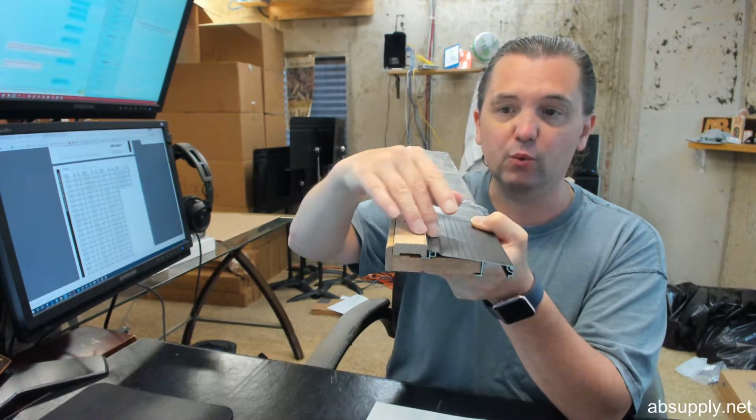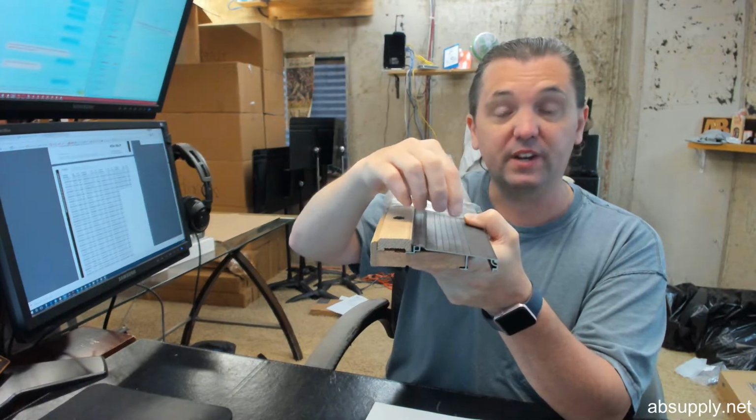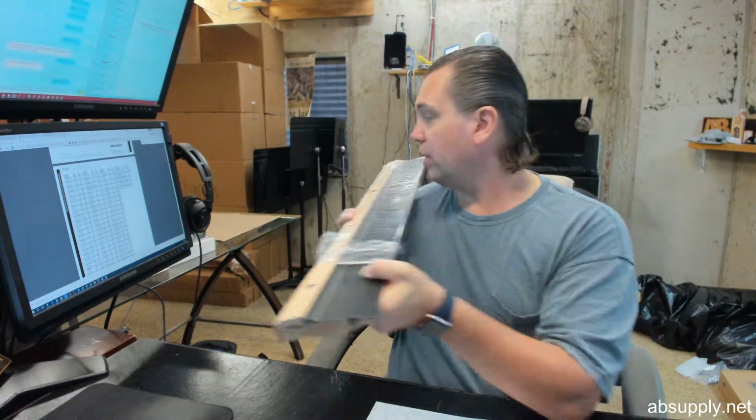Okay. The residential thresholds like this, whether it's the 93518, which is a smaller version, 94518, or the 95518, which is larger than this, you're dealing with thresholds that are intended for the wood pre-hung door industry, like a typical 4 5/8 jamb that you can add extensions to. They make 3 sizes of extensions: a 3/4 inch, a 2-inch, and then a 3-inch are available that will allow you to achieve up to basically an 8 3/4 sort of depth. This is an NT version. We're going to get to that at the end of this introductory area of the video.